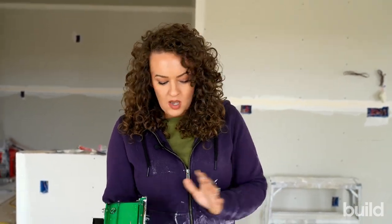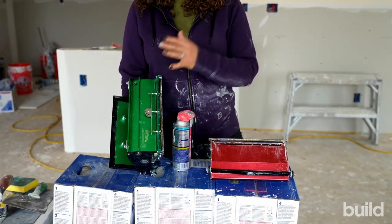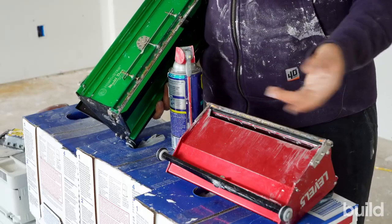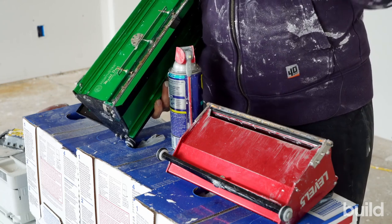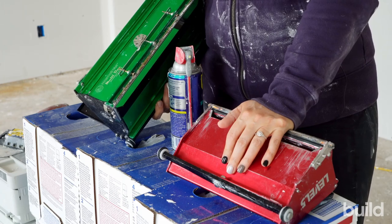These should be leaving pretty close to a glass finish, especially when you're getting to those upper coats. We typically do a 10, then a 12, and then if there are some bad shoulders or we're doing a smooth wall, we'll follow with a 14. A 12 is usually about the highest you're going to need. You can split your butts with 12s, run down the center of your butts with 12s, and break out bad shoulders.